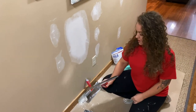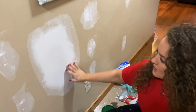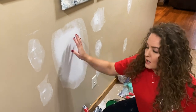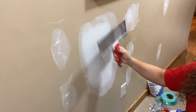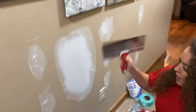My first coat with the all-purpose is dry. As you can see, there's some bubbling. What's happening is the mud on raw fresh drywall soaks in because it's unsealed, but this is sealed with paint so the moisture has nowhere to go and it's coming out the front. When you run into this, it's okay — it's nothing you've done, don't panic. Just keep coating until it goes away. Sometimes it takes a lot of coats depending on how old your paint is, the gloss, and other factors. Take your knife and give it a scrape to open those bubbles so you can fill them — if you sand them, they'll just get full of dust.